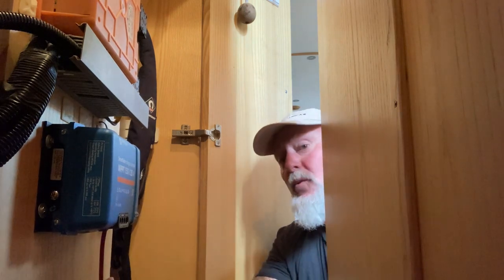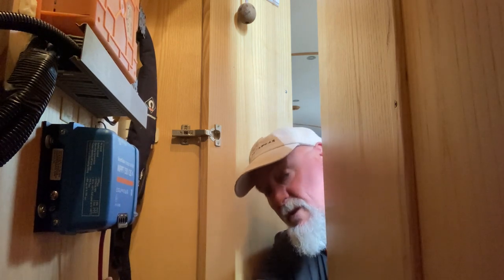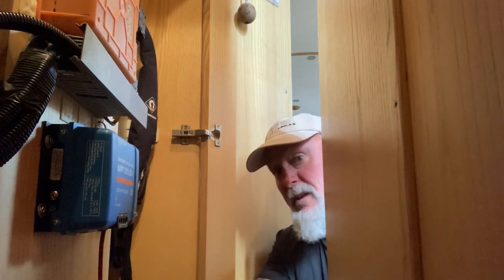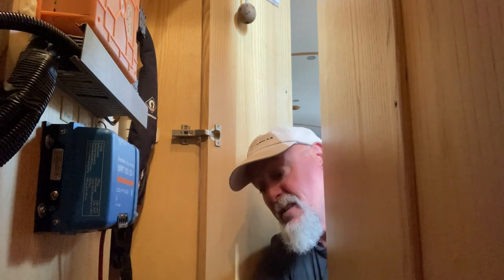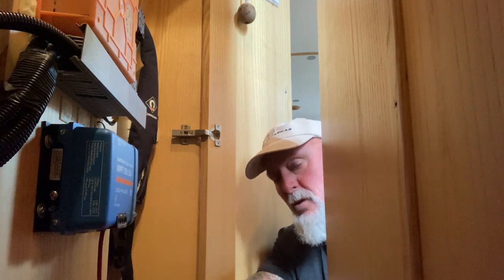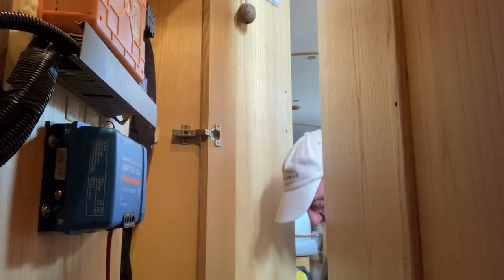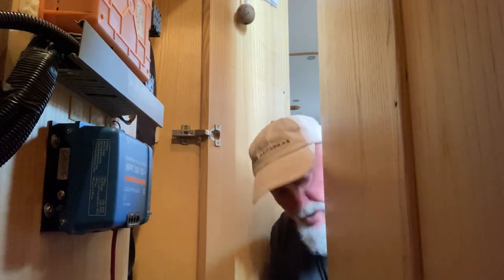And then I'm going up through a 40 amp fuse. With the 40 amp fuse, I'm going to do something on fusing pretty soon. The fuse is to protect the cable, not to protect the controller or anything else, just to protect the cable. So with a 40 amp fuse, the fuse needs to be below the current carrying capacity of the cable. Yep, that's what I work on. So that can carry 42 amps happily. Of course, it could carry a lot more. So a 40 amp fuse will carry the load current happily and also protect the cable, which is what it's supposed to do.